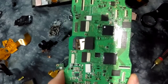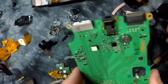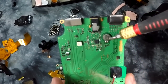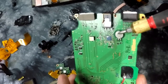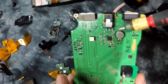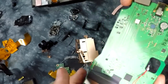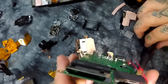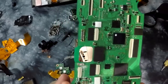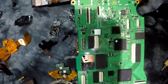Toshiba, it's what's inside your Nikon D500. On the flip side here of the main board of the Nikon D500, we have a rechargeable lithium cell. This saves all your settings, all your little goofy settings you have in your D500, like the time and all your little personal preference nonsense. This is the SD card slot, and there's the XQD card slot. This is a pretty low profile main board. Not a tremendous amount going on here.